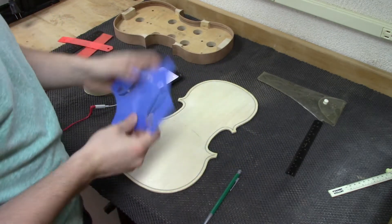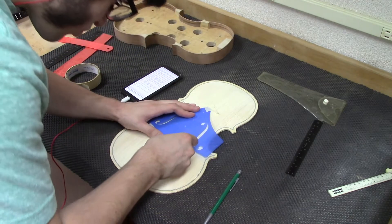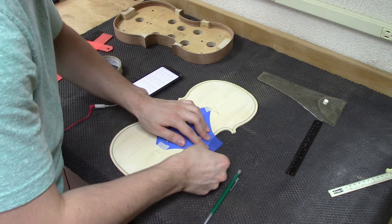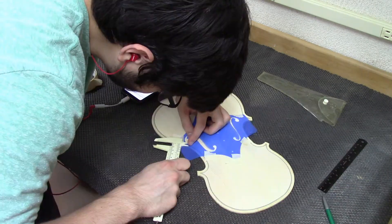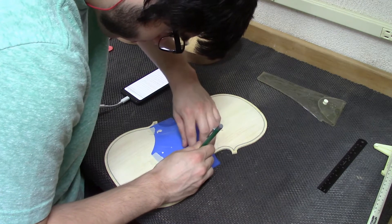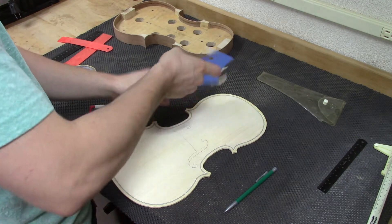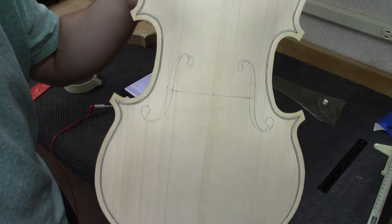This is a piece of plastic here, and you might be wondering how I got this shape — that's because I have a 3D printer, and this is a single-layer 3D print. You've got to print this type of thing on a glass bed, otherwise it will never stick down and you'll never have a consistent thickness. The glass is dead flat so you know you can level your machine out to do this. You might be able to laser cut this, but with plastic so thin I think it would be very difficult to not melt more than you intend. I did some measurements to make sure it's in the right place, and I have holes in the center to help line it up along the center line. I'll trace out the pattern — and I think that's looking pretty nice.